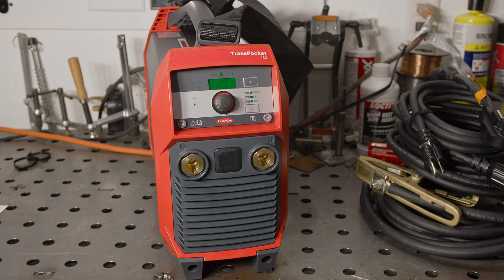You can also adjust the voltage at which the arc will break when snapping out of a weld. When you get to the end of a weld and snap out, either when TIG or stick welding, the voltage will rise as the arc lengthens. Eventually, the arc will get long enough that it cannot be maintained and the arc will break.